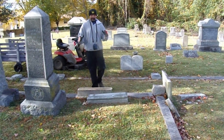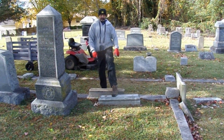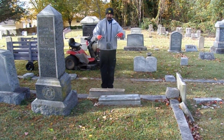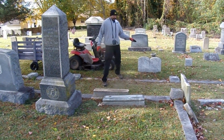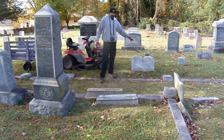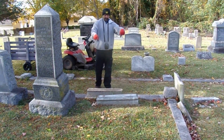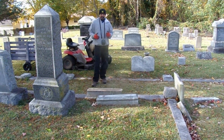But the foundation that we're going to actually reset it to is what you see right in front of me. I'm going to put my foot onto the foundation of what we're going to go to. So we have to raise and reset the foundation. We'll pack it in with the filler material, like you've seen in a lot of the videos we've done before. Then we're going to raise, or basically move, the stone as carefully as we can, and then we may put an epoxy layer on the base, based off of how long the dowel pins are, and then place it onto the stone. And then if there's additional cleaning that needs to be done, we'll continue that.